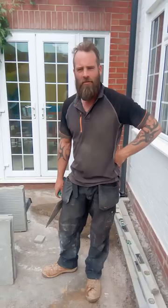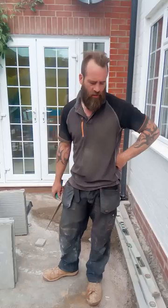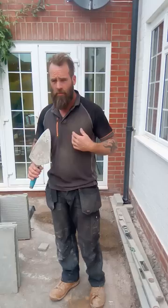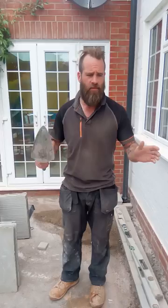Morning guys, John and Jay here, Paved in Stone. That was an interesting video yesterday - it certainly got a lot of opinion out of people. I just want to clear up a couple of things. To be clear, I'm not saying that if you use soft sand in your mix with sharp sand that you're wrong. All I'm saying is that you shouldn't be laying on just building sand alone for paving. Me personally, I prefer to lay just on sharp sand and then SBR bond the back of my slabs. In the past I've used soft sand as well, so I'm not saying anyone's wrong. If you do a 50/50 or 70/30 and that works for you, crack on - that's all good.